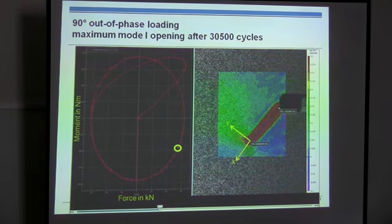I have put here in the PowerPoint a situation of where the moments and the force are at that point. Here's my coordinate system, and this is the profile which we can measure at that point. It is close to mode 1, and when the crack is smaller than that, the figures are all very, very similar. Please note that when the crack initiates here in the notch root, it is locally uniaxially stressed and nothing else, because at the notch root there can only exist uniaxial stresses. So there is no non-proportionality at the initial stage, and the crack grows under mode 1.